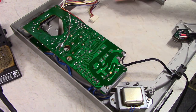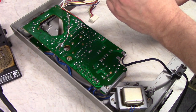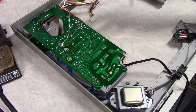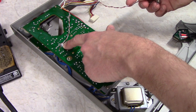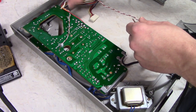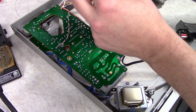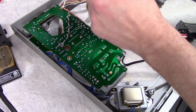So when the switch is in one position, 25K of resistance is across this resistor, and when the switch is in the other position it's open — not changing this resistor at all. I've used some small twisted pair wiring here, a glob of hot glue for strain relief on the solder joints, and then tied it to this cable tie with the motor harness. On the switch itself, once I had it soldered and tested, I put a glob of glue over it too — just to protect the wires and the solder joints.